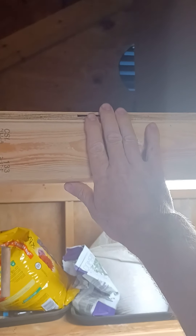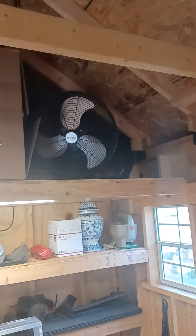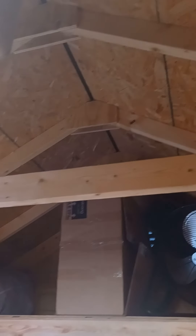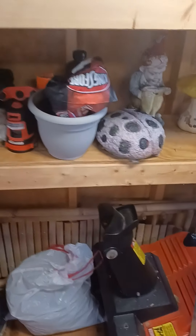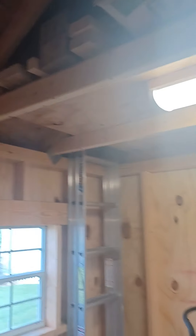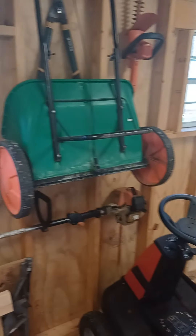Right here — I can just walk under this and I'm six-foot-three, so that made it nice. The rest of that space up there is all nice storage — you could put some big boxes or whatever. One thing I used on this, which I probably already covered, is hurricane brackets on the roof trusses that I made myself, so that all came out really nice. I put two more shelves here and down here, and I can still get my power tools underneath. I tried to maximize the space since I only built an eight by twelve, and I even put a sheet of plywood up there, which gives me room up above the trusses. I got a lot of stuff hanging in here.